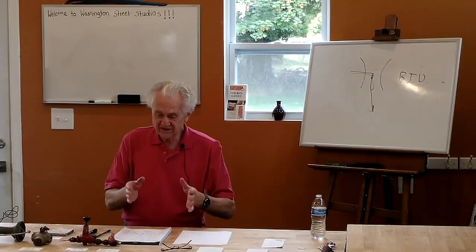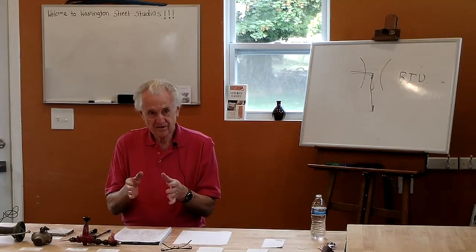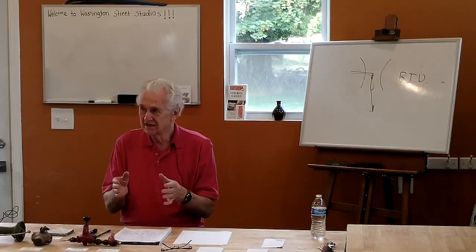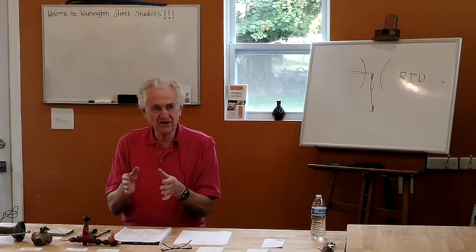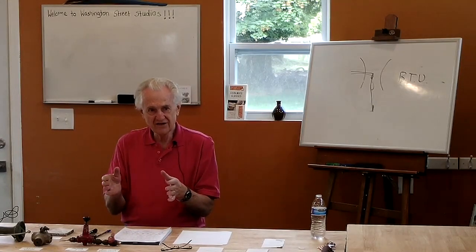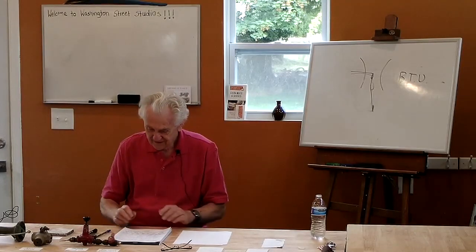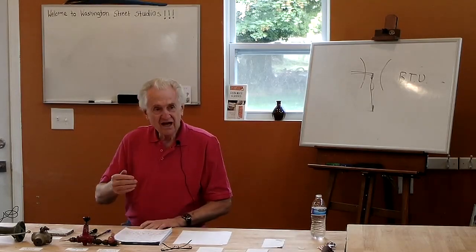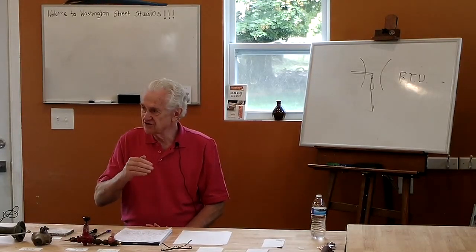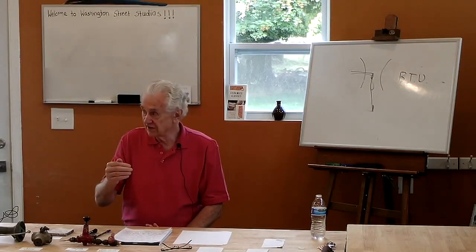Well, most gas kilns are roughly 5% efficient. Roughly 5%, might be 8%, maybe 10, not commonly. But as a round number, 5% is a good efficiency number, which means that 95% of the fuel you're burning is wasted. And that's normal. This is normal, okay? The problem, which we'll talk about again later, is that, as a law of physics, the higher you heat things up, the faster they want to lose heat.